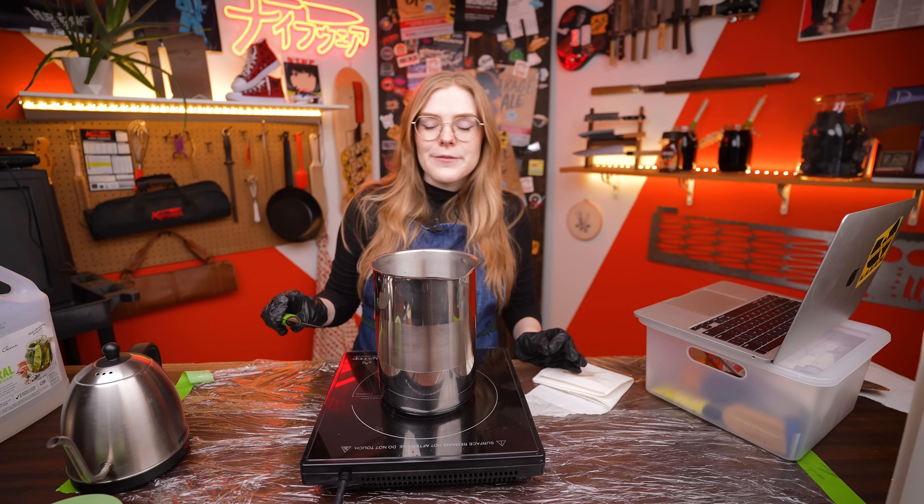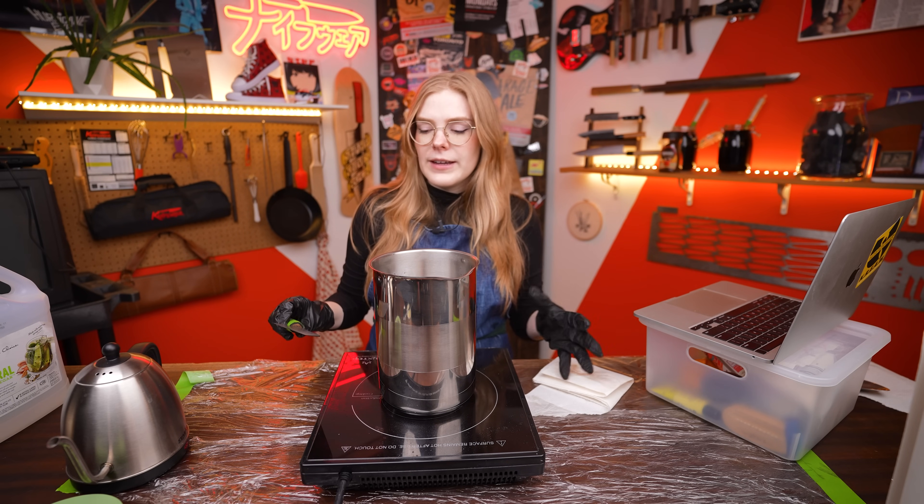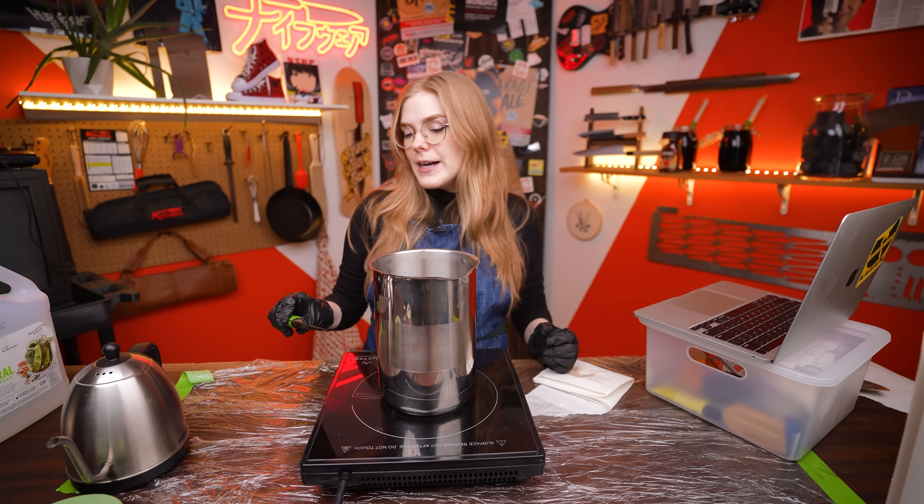One more dip. Check out the colors. Here is after four dips — this one has a lot of blue showing and it turned out really, really nicely. I think that's a good speed cheat compared to just letting it sit in vinegar. You can kind of control how it looks and let it dry as it comes out. Even the wipes form a different bit of the patina. This one's cool, this one's approved. Pretty happy with where this knife is, so I'm putting it down and letting it cool and darken a bit.